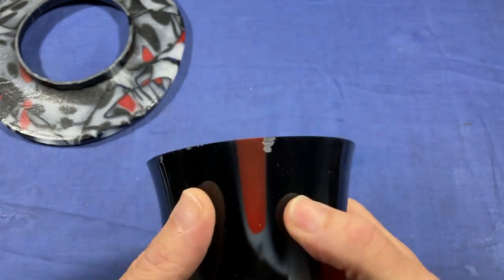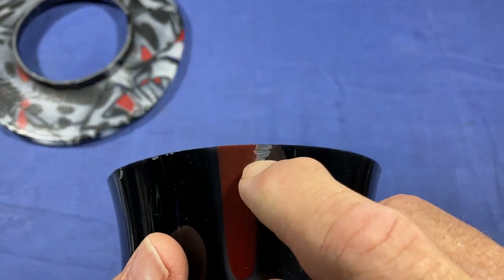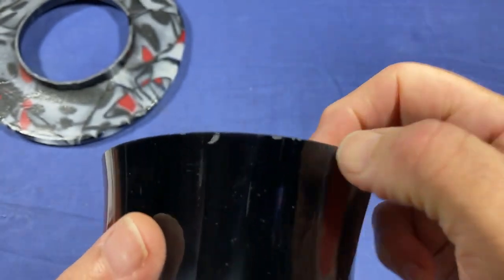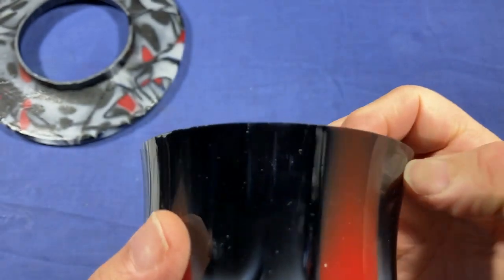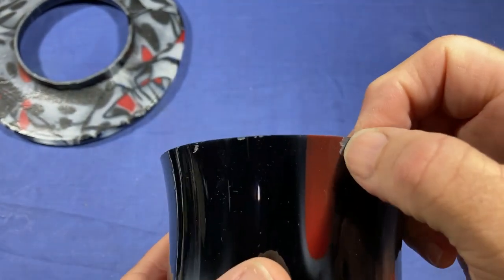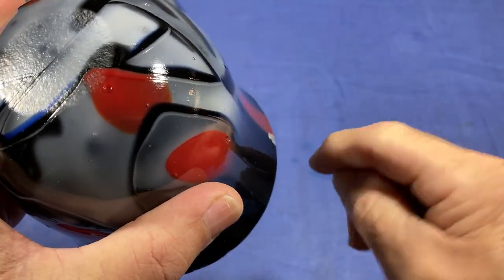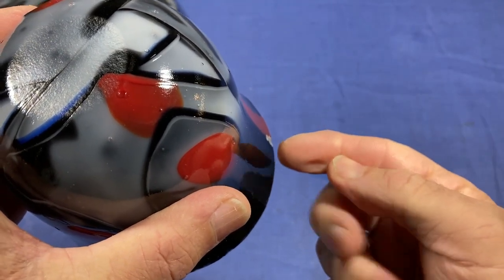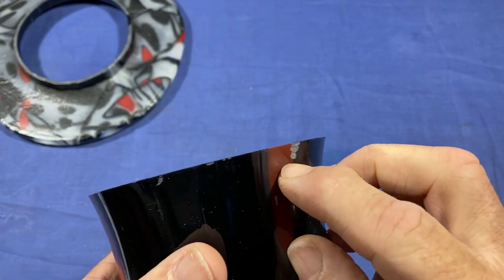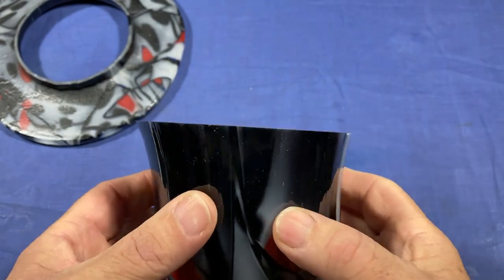First problem — that's from me. When I put the diamond saw down, I touched the side. I've done that in a couple of places. So to get around that in the future, I'll go down into the water further and then come back up to the cut, so I don't cause that. To get rid of it, I would have had to grind a lot of glass away, and I don't want to do that, so that's just going to stay.